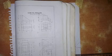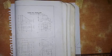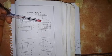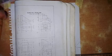To my channel, and here we are going to produce the isometric view of this object as we are given these views in first angle orthographic projection. This is the front elevation and this is the plan, and what we are going to do is to produce the half size of this given figure, in the sense that we are going to divide each dimension by 2. Each of these dimensions we divide by 2.